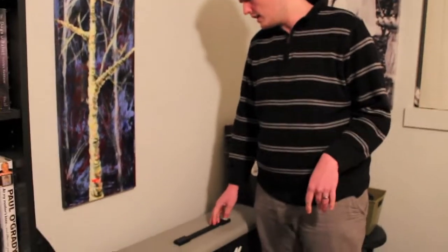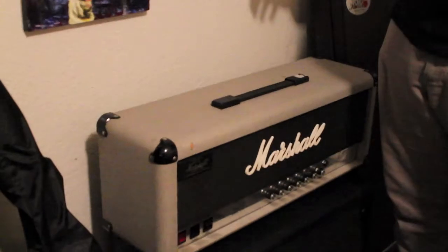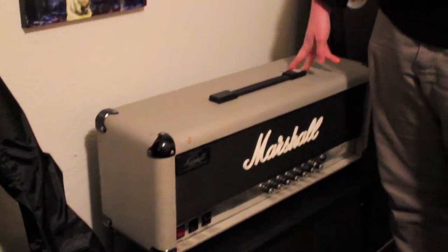As far as tubes go, that's the only thing I want to change right now. It's got a random trio of preamp tubes — like three 12AX7s from different fathers. Then it's got some Electro-Harmonix EL34s, which sound better than the Chinese ones since they're made in Europe apparently. But what I want to do is put some JJs in there — 12AX7s in the preamp and some E34Ls in the power section. Then this will be set and I'll be perfectly happy with it.